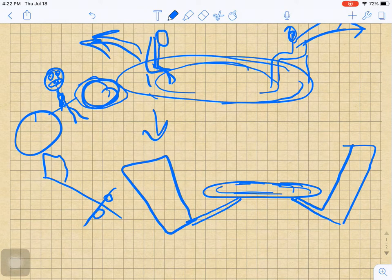My drawings are not good. So the same way as you experience right up here, these flyweights go outward. And what happens to that disc is basically it's being pulled up. So this goes up, and that disc will pull up that pilot valve with it, right?